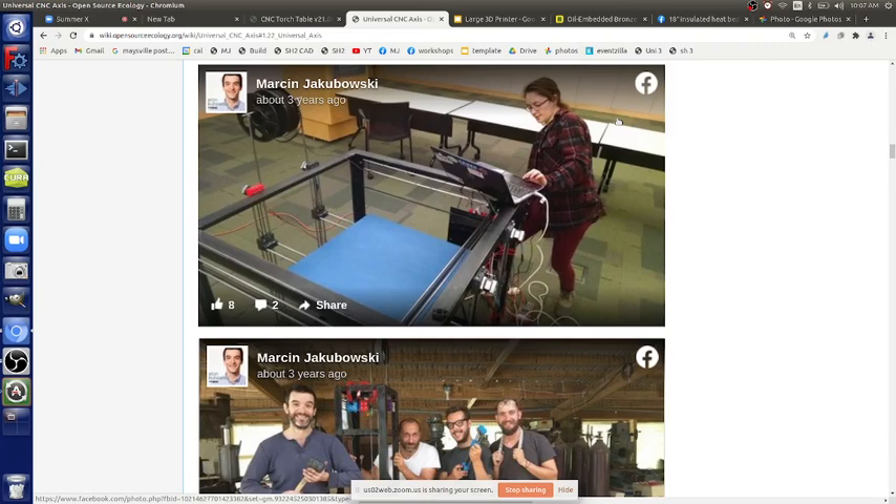The steel bed plate is about 45 pounds without the honeycomb reinforcing; the honeycomb could be around 5–10 pounds. We could use a lightweight mesh on the bottom rather than full steel. For heating we'd use four to eight halogen lamps — eight would be 2000W, but 1000W would be plenty. Halogen lamps are actually much more efficient because they're radiant rather than conductive heat transfer.